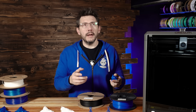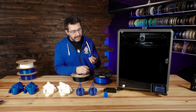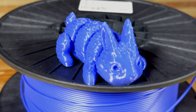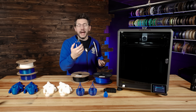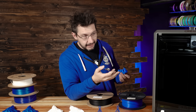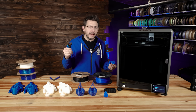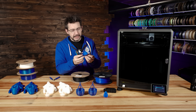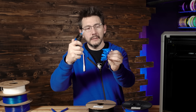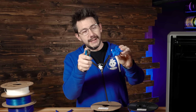With the PETG still loaded, I backed it out because I had to swap the nozzle. I took the 0.4 out, put the 0.6 in, and printed myself a wee little bunny rabbit. It's a little furry — just a little bit furry. Now, rather than a heat gun, my tip is to pick up a torch because you can take care of the filament wisps much easier and much cleaner. And just like that, they're gone.